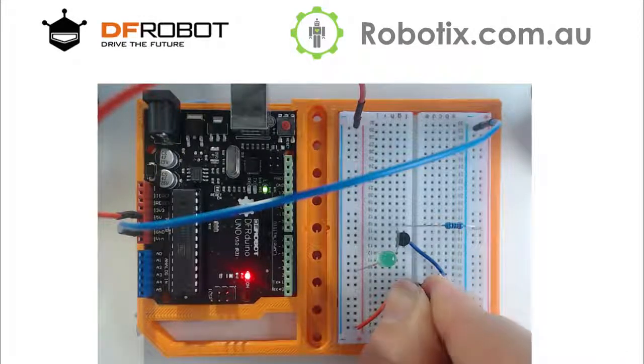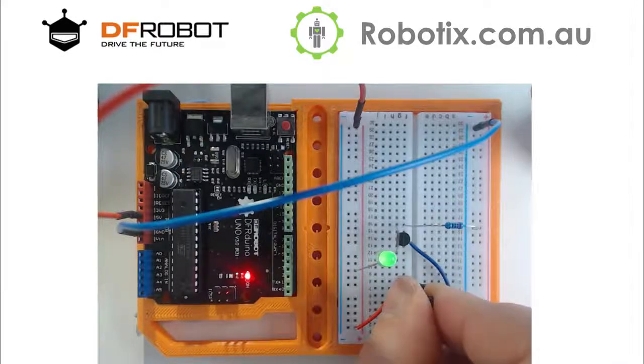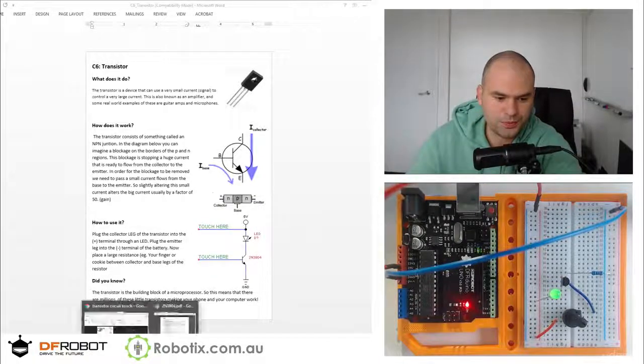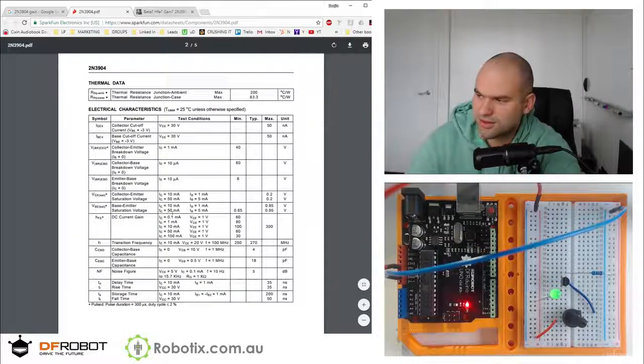Okay, now you guys know how to use a transistor. Now, one last note, perhaps, just in case you're going to go from here to try to construct more advanced circuits. Let me go back to this view. Make sure you look at the transistor data sheets, and what you're going to find is that they behave very interestingly. They're almost a little bit temperamental. The transistor we have in our hands has roughly a gain, an amplification effect, of 100. That is at 10 milliamps and 1 volt. So we don't even have information for 5 volts, but I think it remains reasonably constant.